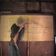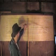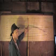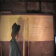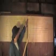This bow is already strung, so it's already been worked to this position, so it's not detrimental to have this short string on here. We'll go ahead and put this one up there and flex it so that we can look at the limbs and see if they're bending correctly. This tillering board has a pulley system, so that I can stand back and pull the rope. It's got a hook here, so that'll hook onto the string. Let me go ahead and put that in there.